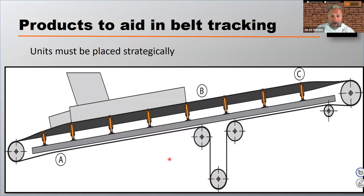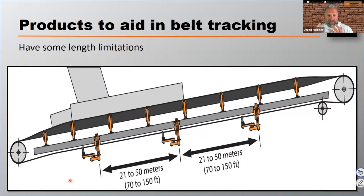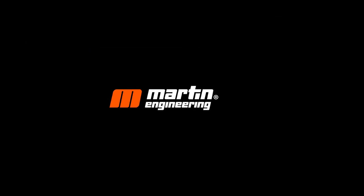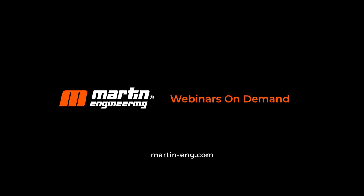If you want to do your clients a solid when building, designing, specifying, or upgrading a conveyor belt, you should include these units at points A, B, and C. Note that dynamic devices have about a 70 to 150 foot reach depending on belt speed — passive devices have much less impact and less reach than a dynamic device. That's a critical component that should be considered.